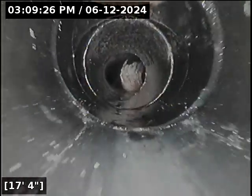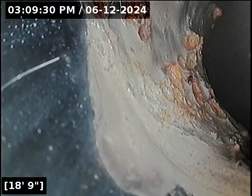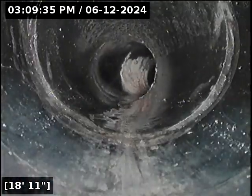That little tie-in there at the top of the pipe, I get this question a lot. People are worried about a party line or something like that. That's a test T connection. Every sewer line on earth has one, and you will always have it right before the transition joint.